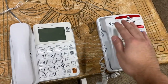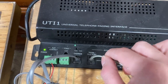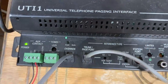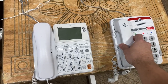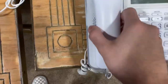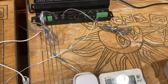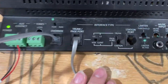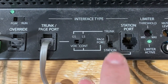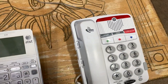There are two phones here with no phone system — this is assuming you don't have a phone system but only have two trim line phones or one trim line phone. This one is the trunk phone connected to the trunk port, not the station port. This is the trunk mode and this is the override — you'll hear the difference.